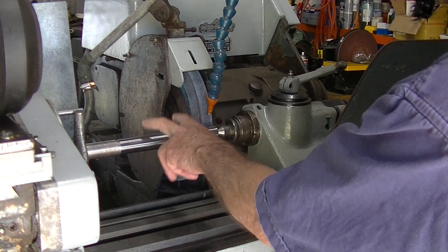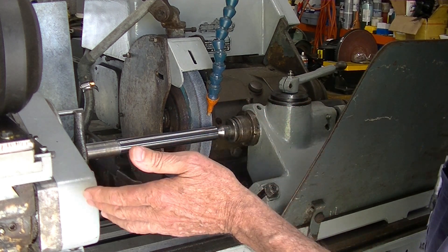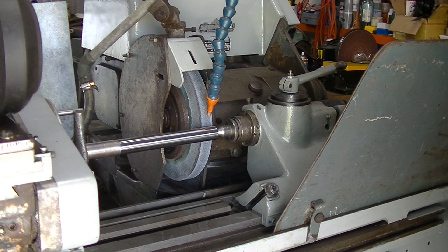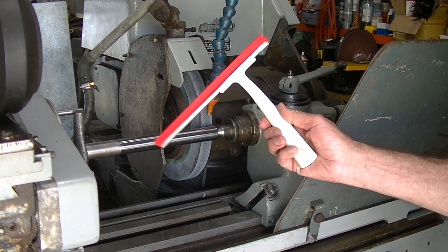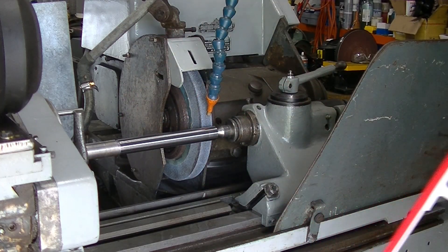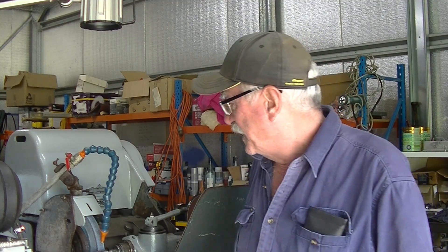This will be my test bar for the lathe - I want to do an alignment check but it's good enough: when I put a new job on and have to move the tailstock, I can throw that bar up between centers and do a rough alignment. I'm getting a bit better at unclamping the table and I'm using a micrometer with the base jammed in the tub, which made a hell of a difference. Boy, that is a bloody good result. There was a comment about a corkscrew effect visible on the surface - I could see something faintly, but you're talking about a millionth of an inch. It's now zero, I can't see it on any angle. I'd say that effect is out - possibly it was swarf being regurgitated around the machine.